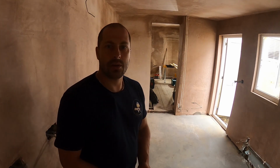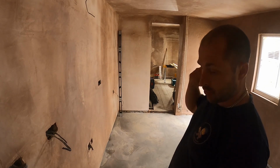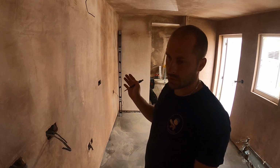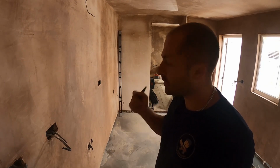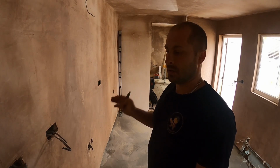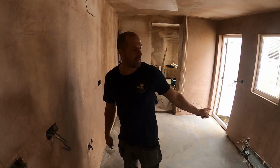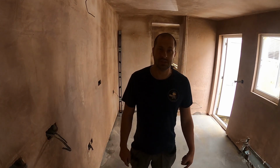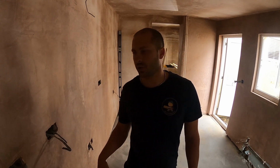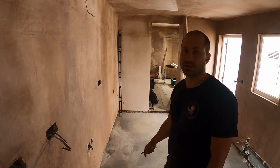Just a quick one. The first job we always do is actually draw everything on a wall. Either it's a wardrobe or especially if it's an angled wardrobe. With a kitchen it's the same. We draw everything on walls to make sure everything will fit, and then we just start cutting. I know I haven't shown in previous videos that we do it, but this time I'll do it.